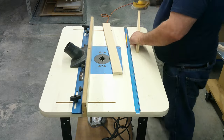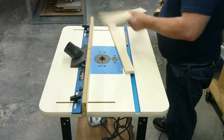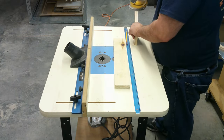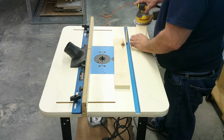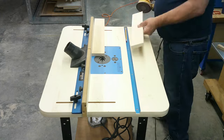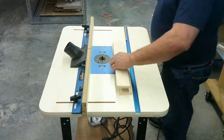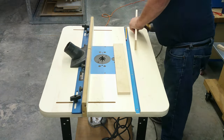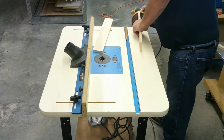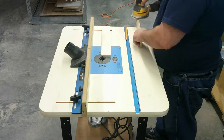The fifth step was to cut the 5/16-inch wide slot in the adjustable post and drill the holes in the base posts. I set up my Rockler router table using my DeWalt router and set up start and stop stops to control the length of the slots. I made the cuts in several passes to avoid burning the router bits or wood. I used Microjig push blocks on the final few passes for control and safety. If you look closely at one of the boards, you can see where I moved off the fence and caused a bad cut — not bad enough to scrap, but bad nonetheless. I cleaned up the dust as I went to make sure I was on the fence with each cut.